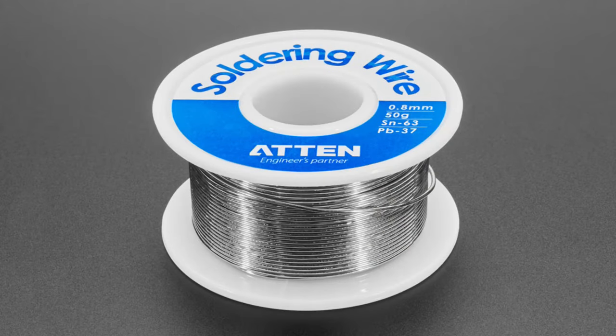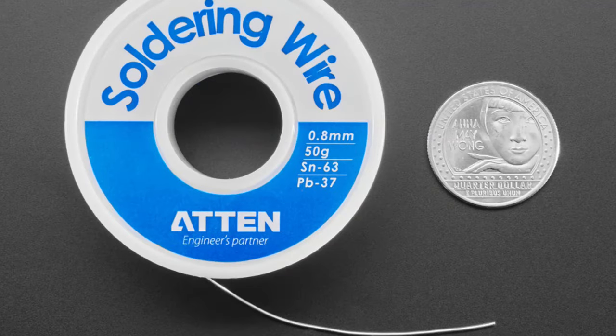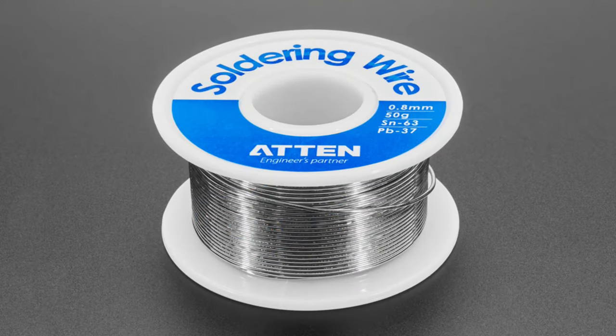Next up, we had a request for some thicker solder wire. This is not lead-free. It's leaded solder. I know this isn't 60-40, but I call it 60-40 because it's like 63-37. It's very, very close. It's actually hard to get true 60-40, but this is close enough, I think. And it acts the same.